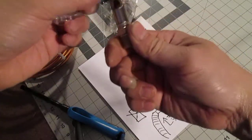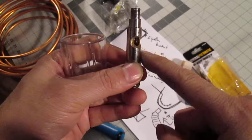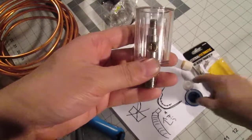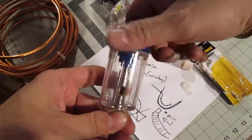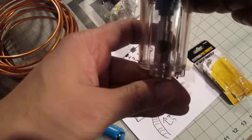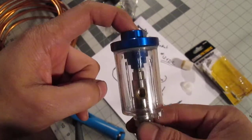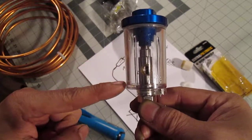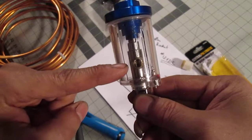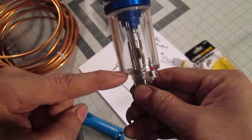What I did was — if you can see that moon shape right there — I sat there and filed it all the way down with a file to make it a moon shape, and I've tested it. When you put this in here and put all the contraption in without the filter, that would be your indicator. Oil is going to come through here when you turn on your needle valve. It's going to fill all the way up until it leaks through that hole — so that's your indicator. If the flow rate goes too high, you can mark this section right here, put a sticker or whatever, and see if the oil filled up to a certain level.